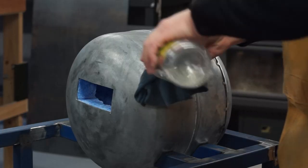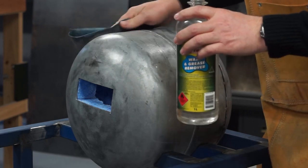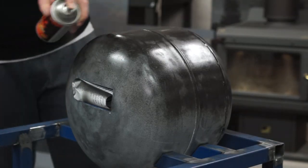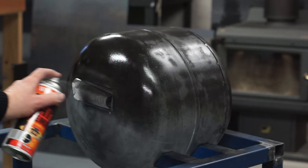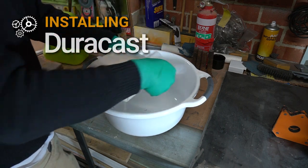In this shot, I've flipped the forge over so I can lay some paint down before welding into place. I only tack weld the forge in four places. One tack weld for each of those cradle brackets. There's plenty holding this forge in, and one day I might want to repack the K-wool or keep the table and put in a different forge.